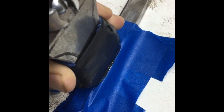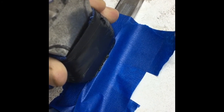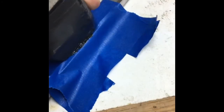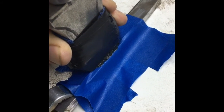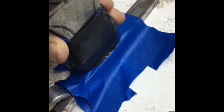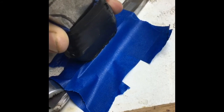The battery charger I had went really deep — I think it burned through portions of my stencil and actually etched the metal through the stencil, and I was very disappointed in that. I think this system delivers just the right amount. I'll have to get used to it and see how many pad applications I need to get the depth of etching I want, but this is already an improvement over the nine-volt battery and alligator clips.